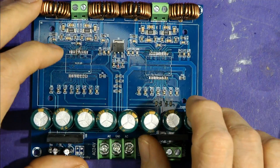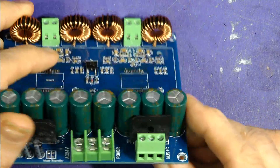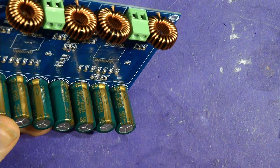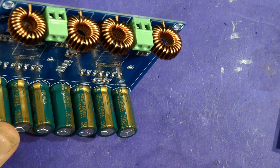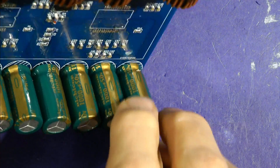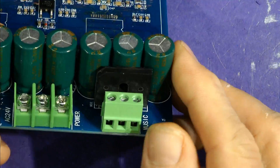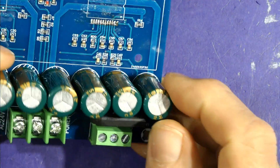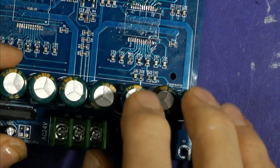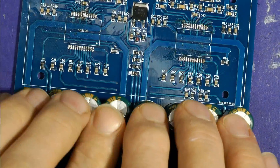These modules are about 20 to 30 pounds. I bought two to compare. We've got some 1000 microfarad 50-volt Nichicon capacitors — but these aren't genuine Nichicon. All the genuine Nichicons I've seen from a proper electronics distributor have pristine printing on the already-shrunk capacitor. These have been printed on the shrink wrap before shrinking, so the print is all wobbly. They're also 12mm by 25mm for 1000µF 50V, which is pretty small, telling me they've probably got crappy ESR. An amplifier like this would normally have 3,000 to 6,000 microfarads on each rail.